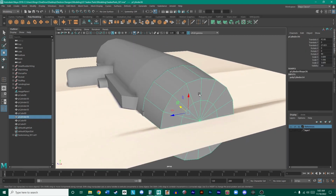Oh, that's right, we need a hole in the end of this. Let's get that measurement right. It's going to vary depending on which one you have, but since I have the original here, we're going to base it on the original, and not the reproduction, rather the reissue. So let's figure out how wide this hole needs to be, because there needs to be a good clearance on the hole as well. Looks like it's 7.33 millimeters. Should be a little gap. 7.33... Oh no. Hold on. Let's measure that again. With the widest diameter, we're at 7.38 millimeters. Gotcha.